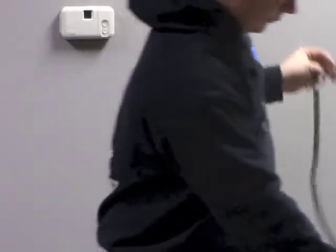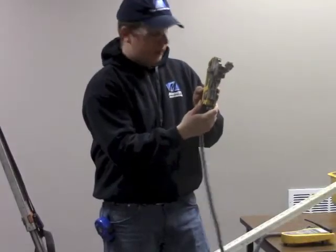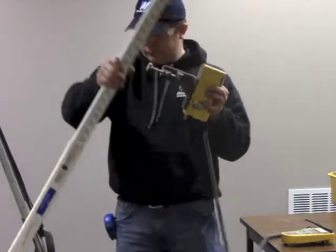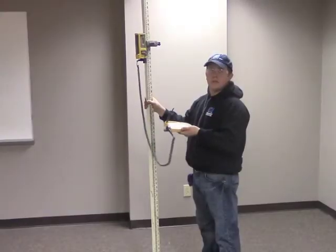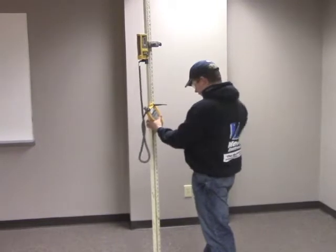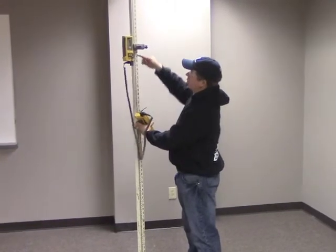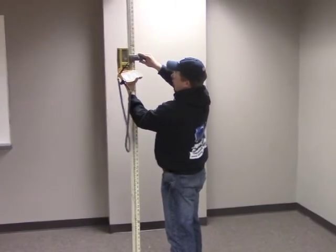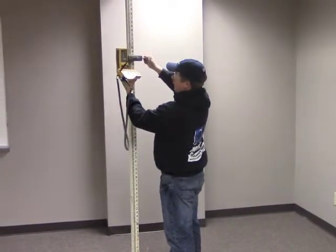Same with the eye — contacts there. Now they're hooked up and they're aligned. Put your eye on your laser and your grade rod, then walk to the other end of the building you're grading up against. I've measured off this wall 6 foot 11 and a half to match where my laser is at the other end. The laser eye is reading tone — it doesn't matter whether it's on tone, low, or high, just as long as the eye can see the beam.